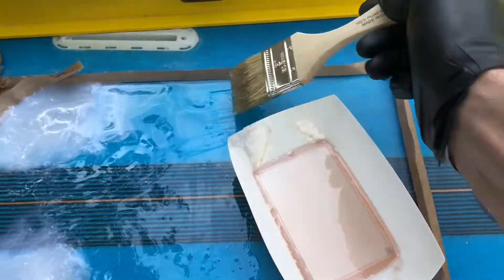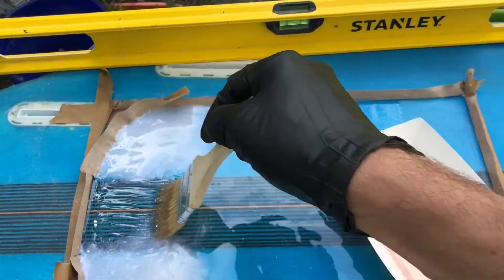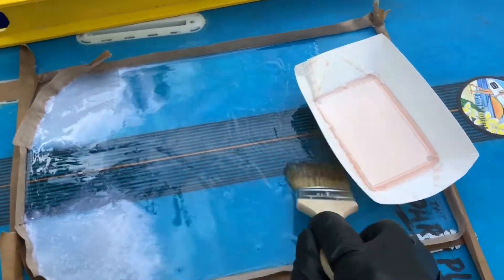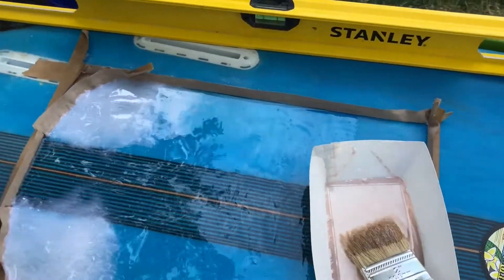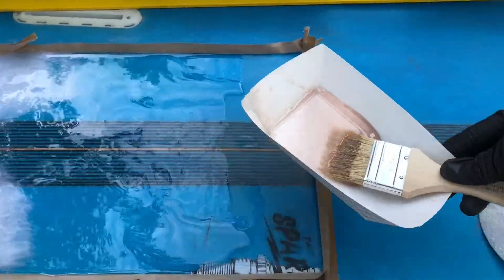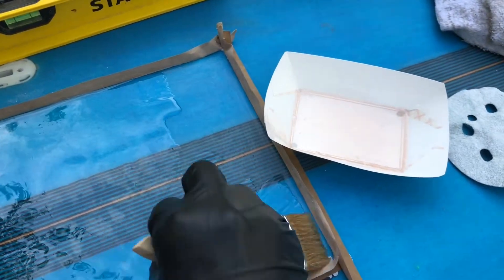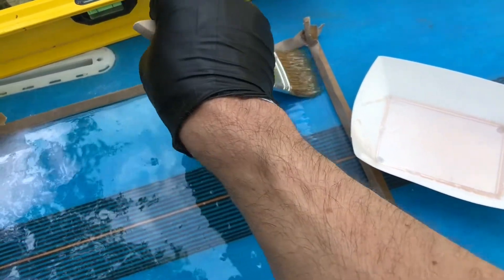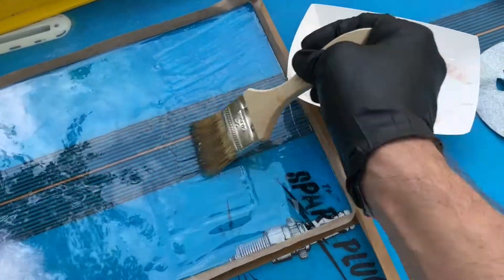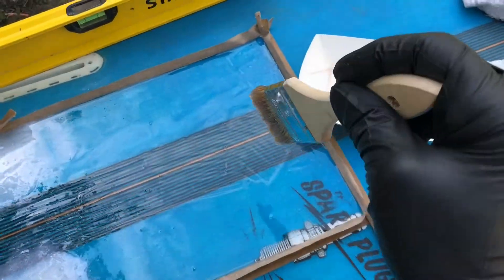So this is the most important part, as I already mentioned. After you get this resin on there, you want to make sure and double check that everything's level. You can see I have my level out, both front to back and side to side. You can fix it later if it's not level — you can always sand it down with the belt sander. But it's so much easier if you just start with a level surface, do your due diligence to get everything as level as you can, and then it just makes it easier later when you go to install.